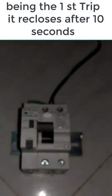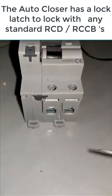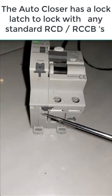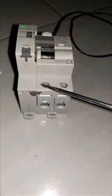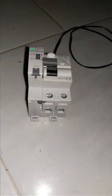Immediately after that, you test. If it is a standard unit, it will have a means to lock it even without the advantage of a DIN rail behind, but if you have the DIN rail it is an added benefit. It will lock and behave as if it is a single combined unit. You can also easily buy it as a single combined unit — whatever ampere rating and breaker configuration you need, if you can define it, that's it.